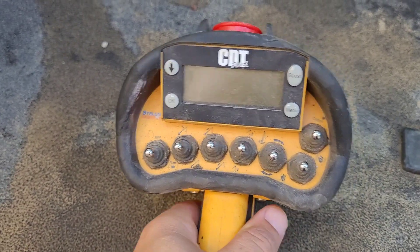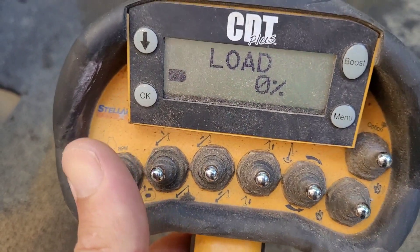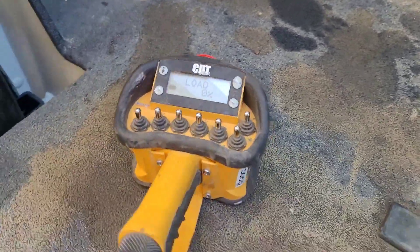Going back to the comparison with a maintainer body, they have a difference in control of their flow and that kind of issue wouldn't fly. But again, that's just the Stellar crane setup and how they happen to do their priority flow. Not a big fan, but I do kind of like where I can access these manual controls a little bit easier than on the maintainer. I bring this up because it's 2023 and we are still using these style controls. Maintainer kind of spoiled us — if you had a maintainer body, you got used to that remote control with a real easy detent, and you could pretty much operate the crane with one hand easily. I'm still getting used to this setup. I guess I'm just not coordinated enough to do two things with one hand and also hold a tagline.